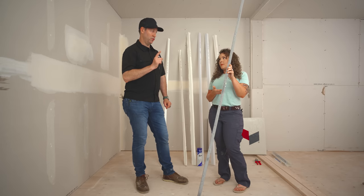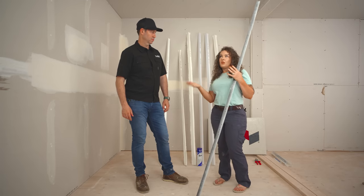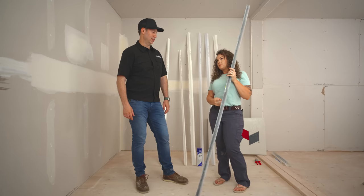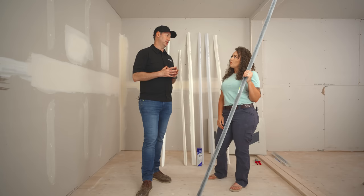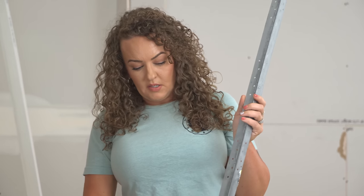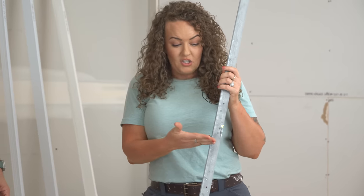It's metal — it's flimsy, you can bend it, it will dent very easily. However, you can fix some bad framing with metal. Even though it's kind of old-fashioned and maybe not the best choice for everything, it's absolutely the best choice for fixing wonky framing. On a house with 18 corners coming together, soffits, and everything having to be bang on — that is when we use metal, because you can manipulate it immensely. From a service perspective, I'm always worried about metal: if it gets dented or dinged, it's hard to patch later. When hit, it will crack right up that side. You can dent the nose, and if it's really crushed, you can't fix it. But most of the time you can bang it back because it is so soft.